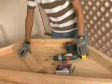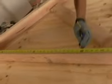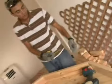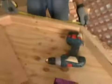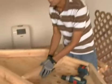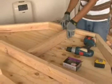After this one is going to come our 23 and a quarter inch piece, which is this. Now how we find the layout for this is we know we have six foot from this end out to this end, and we want it directly in the middle, which is going to be three feet. So we'll go ahead and make a pencil mark right here. Then we can go ahead and measure out one foot and give ourselves a pencil mark right there. So when you're setting in this beam, you want the center of the beam to be where your pencil marks are.